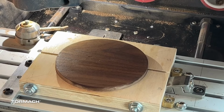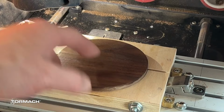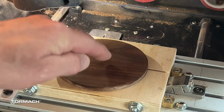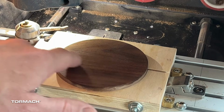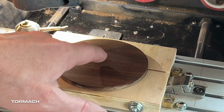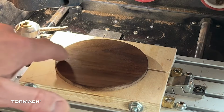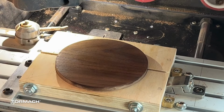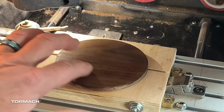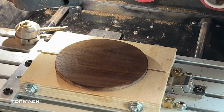All right, the last thing that we need to do is engrave. Now, remember, if you're going to set it at the center, and then however large your text is, you need to run to the bottom of that. My suggestion is, before you actually do the engraving, run this about 3 or 4 millimeters above and just cut air so you can see if this is the alignment that you want as you're placing it. So that's some of my tricks that I do. I also oiled this a little bit so I have a little bit more of a contrast in order to see that engraving taking place.